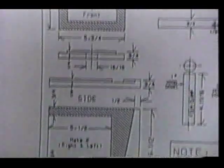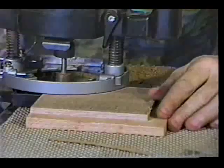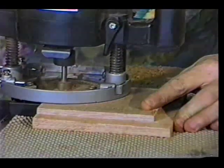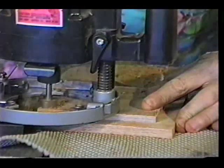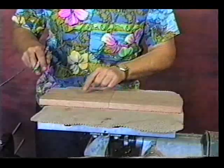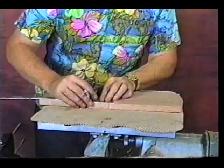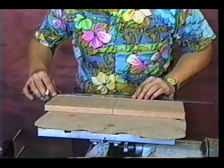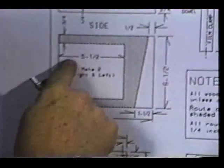All the pieces that are shaded in the plans have to be routed out — we're showing the top piece. This is the last cut on the routing, and we use a three-quarter inch router bit with a little guard to make sure all of the cuts are three-quarter inches deep to match the three-quarter inch width of the wood. Here are the two sides. We lay them end to end so that we can make a left piece and a right piece. Notice the angles are different — this is very critical. You don't want two right halves or two left halves; you need to make a mirror image of each other.